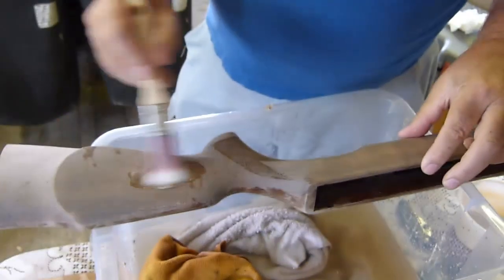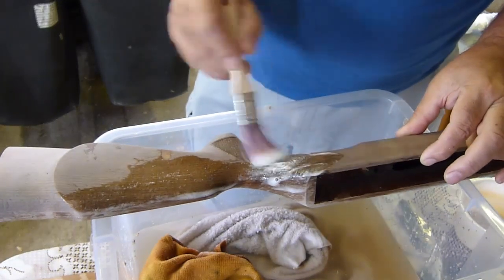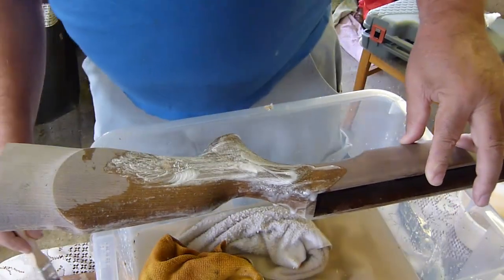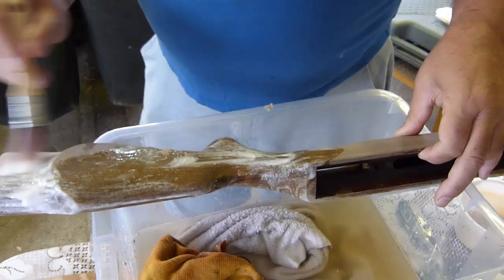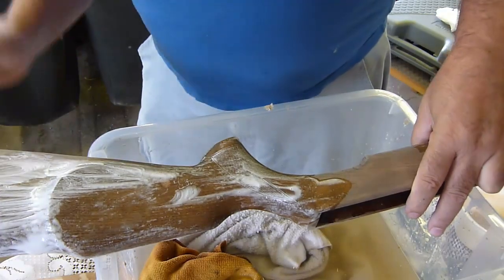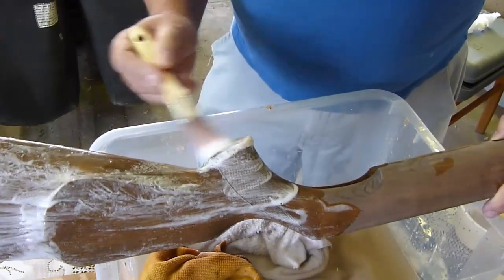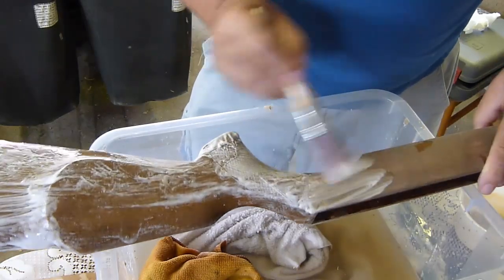The process of removing the stain: I'm getting the bleach and working it into the wood with a paintbrush. This allows me to get it right into the checkering, all the nooks and crannies and the profiles of the gunstock. I'll give it maybe two or three coats — basically keep going until it looks how I want it, nice and white, a nice even base to start my new stain on. Then I can work it to the colour I actually want. I'll just leave this to do its work and draw out all that stain originally put in.